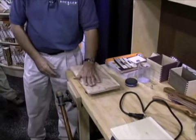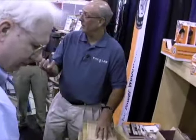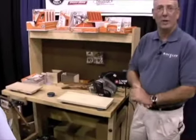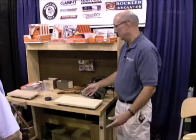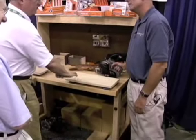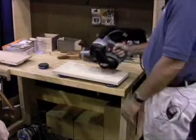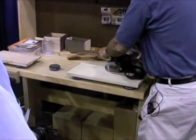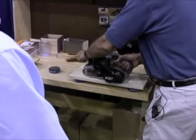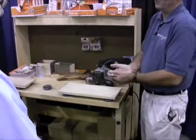If you're doing finish sanding on a piece and want to work on the other side, you can flip it over — you're not going to mar the surface. Here's a demo we provide to show how well these really hold. There's nothing securing the board — we just set them on there. With an 80-grit belt on a belt sander, a brand new belt with a pretty good grip, the bench cookies hold the work piece in place. If you don't bear down too hard on the sander, it'll hold almost anything.